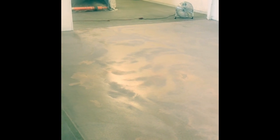Okay, 1 hour later, the Plastifloor 332 membrane is already cured. You see, it's a little sticky on the top, but there's no problem. We will broom the sand excess away, and then we can install the 418 base coat, self-leveling, and give it a full broadcast with color quartz. This guy wants to have a solid color on the top. But anyway, we broadcast it with color quartz because this will give us a better surface, and then two colored seal coats on top.